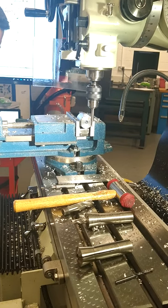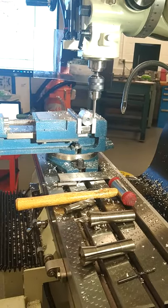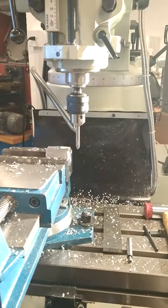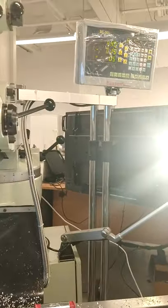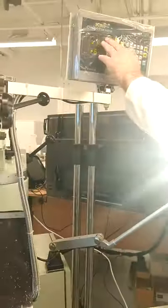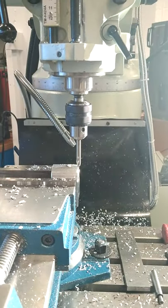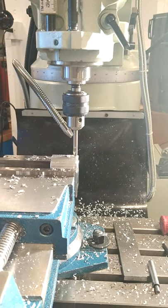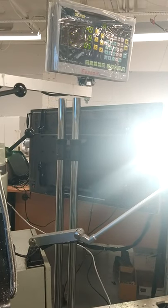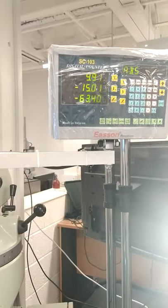And the location now for this hole is in 10 millimeters from the edge. So winding in. The edge finder is just at the edge now, you'll see that it's reading zero there in your dial. And then the tip of the edge finder is right over the edge of the part, so it's in 10 from that location to the center of the hole. So in 10 millimeters to the center. And that is bang on.